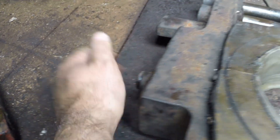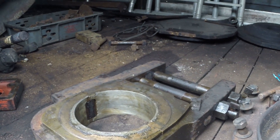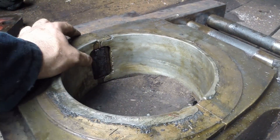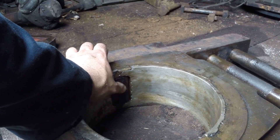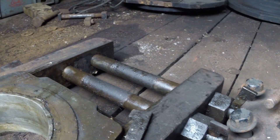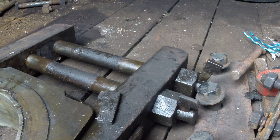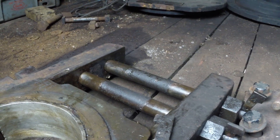It's a real job to get these together without squashing the felt, because it locates inside there with little tabs, and when you're fiddling about between the crank webs it's quite hard to get that right. Anyway, it transfers oil from the oil point up here - there's a cork in the top. This square part is hollow and machined, and there's a cap fitted with a very slight chamfered edge, just peened in - so that's the oil reservoir and the felt that transfers it to the big end. Replacing these felts is a maintenance job done every so often because they get clogged up with gunk and then don't transfer oil very well. The pins are secured with a couple of nuts at the bottom and some giant split pins - they're what actually secure the horseshoe to the connecting rod.